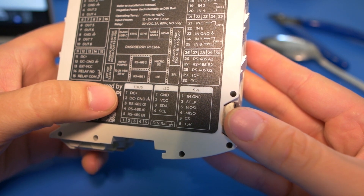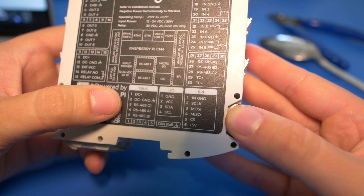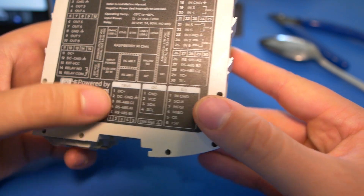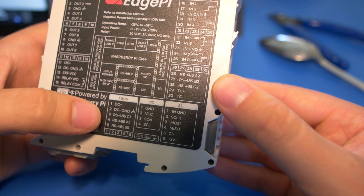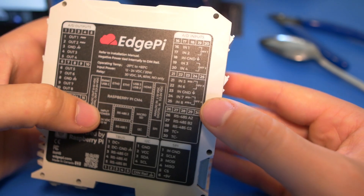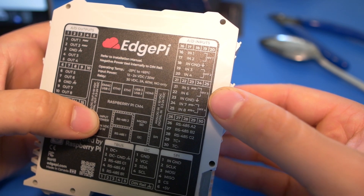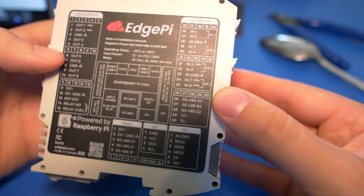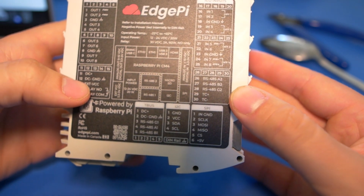There's an isolated RS-485 port, an isolated I2C and isolated SPI. I'm not sure how useful those would be in an industrial setting, but they are there if you need them. There's another RS-485 port that is also isolated, which is super useful having two of those. There are A2D inputs as well — many marked as differential inputs, which are super important in an industrial environment.